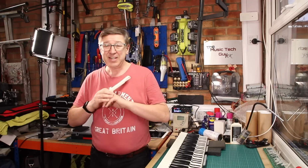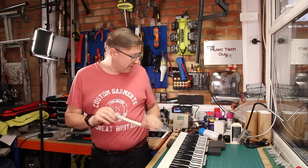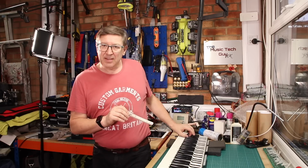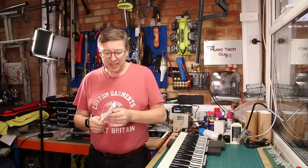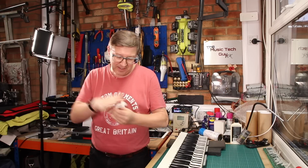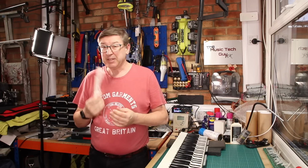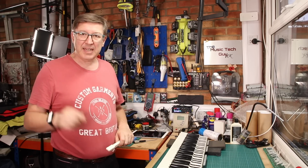And that's my theory. I have nothing to either prove or disprove that that's what actually happened, but given that it was 3 keys in the same area, that's what I think has happened, is something has effectively hit the keys like that. So something's been dropped on the keyboard, in other words. But this will now go back into the chassis.